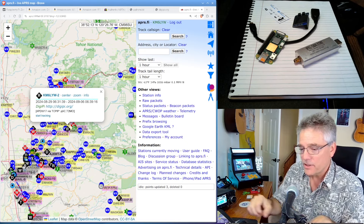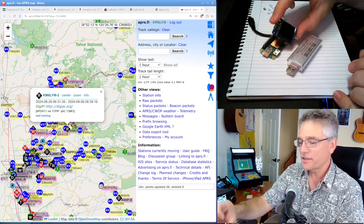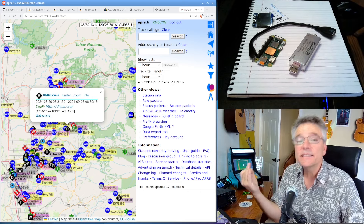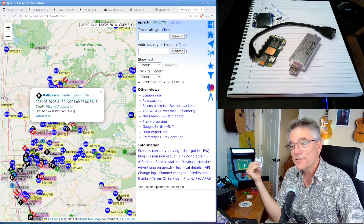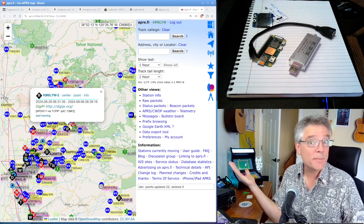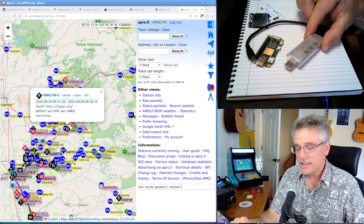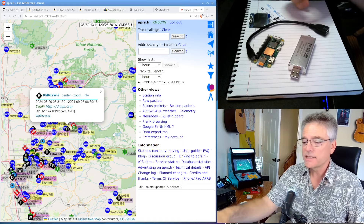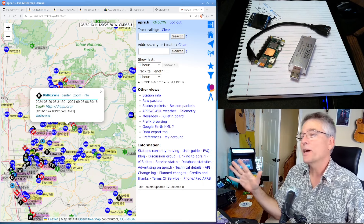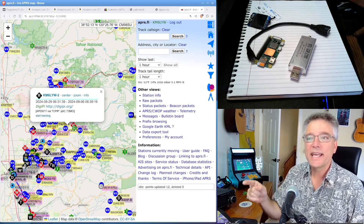Probably the most important is that you can do APRS text messaging with most APRS-enabled radios and DigiPi's and TNC. So what we are going to do today is use a Raspberry Pi, an RTL-SDR receiver dongle, we're going to have this cool little screen on here for fun, and a USB cable, and we're going to get all this stuff for $99 and make an APRS packet radio receiver. This picks up the packets flying through RF over your house and forwards them onto the internet. You don't even need a ham radio license to build one of these, because this is going to be a read-only, listen-only device. We're going to do all of this for $99 and install it all in under 10 minutes.